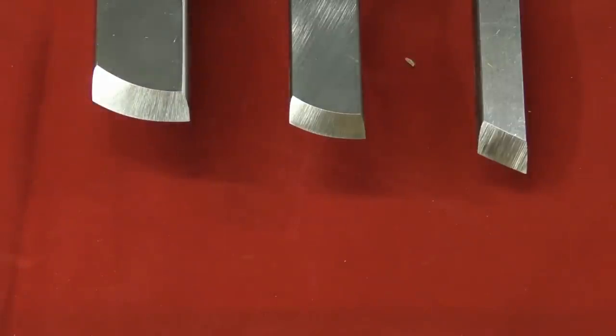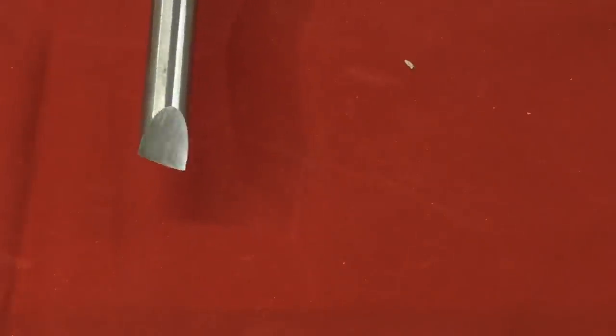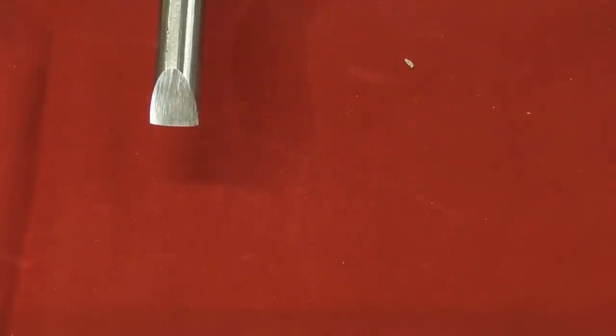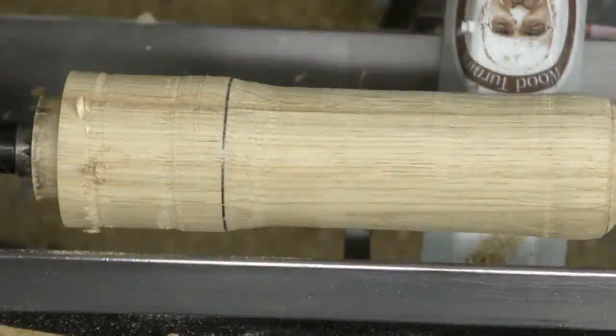As I said in the beginning, I'm no expert, but I find the radius skew quite a bit more forgiving than the straight one — that is just a personal opinion. One final design I have is the round skew — this is made from half inch round stock, again a 25 degree bevel on both sides, with a very gentle slight radius, again personal preference. There is one other design called the oval skew — I don't actually own one because I don't like them, but again that's just personal preference.